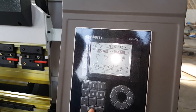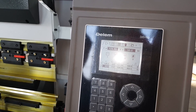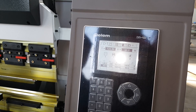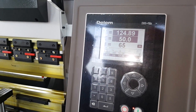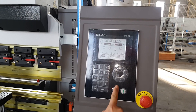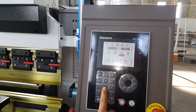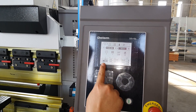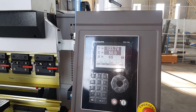This back gauge size is 90 degrees, back gauge 50 millimeters. We will use 2 millimeter thickness, so we need to change the thickness to 2 millimeters. At 90 degrees, the back gauge will automatically change. So let's go.